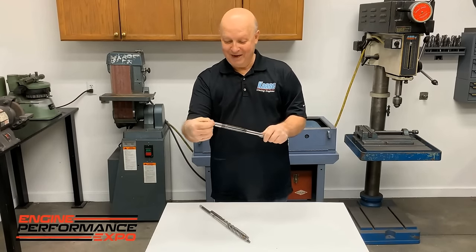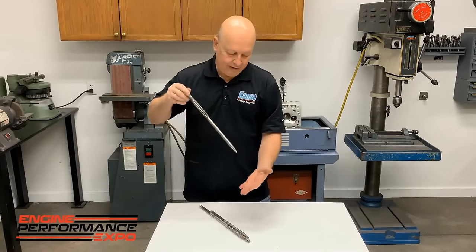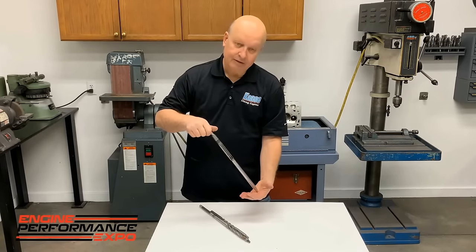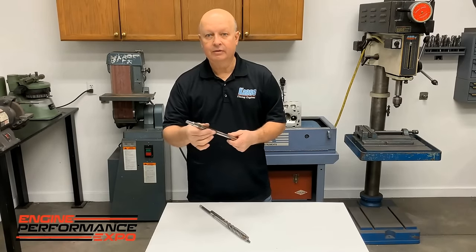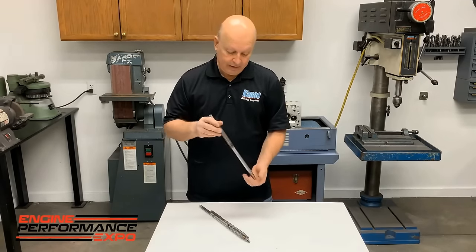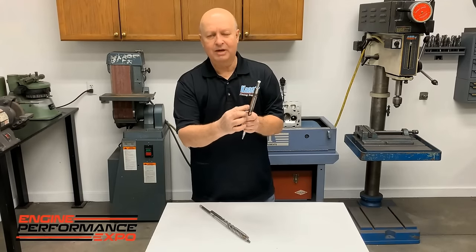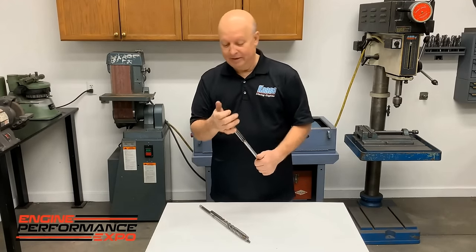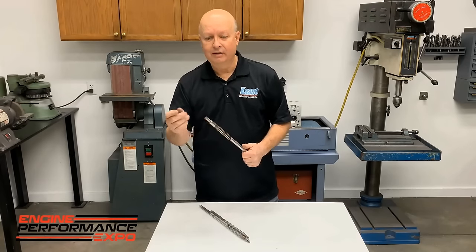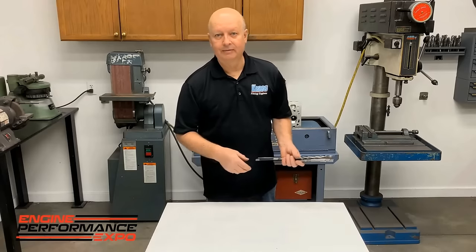I used to have a table where we could put it in a drill chuck, put it on a push rod, put it down the block, and spin it. Even though the motor's together, what we do is we pack this with grease. Okay? And you get down in there and you just give it a little bit. Usually it's not a parallel cut where it's cutting all up and down the whole thing. It's usually one corner or something. And you just ream it over a little bit and clean the grease out of the head. And a lot of times it'll make your life easier when you then take it back apart.